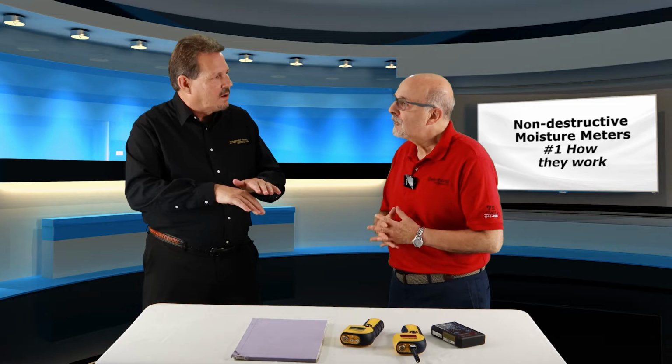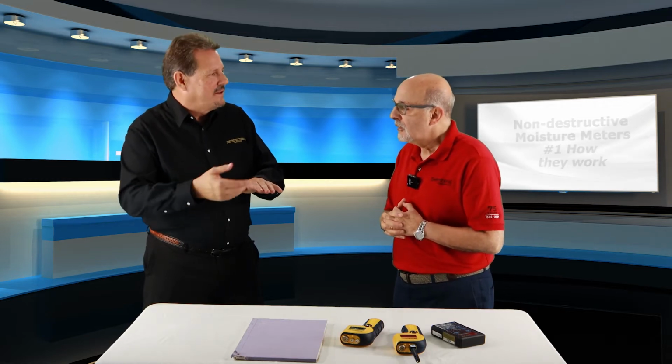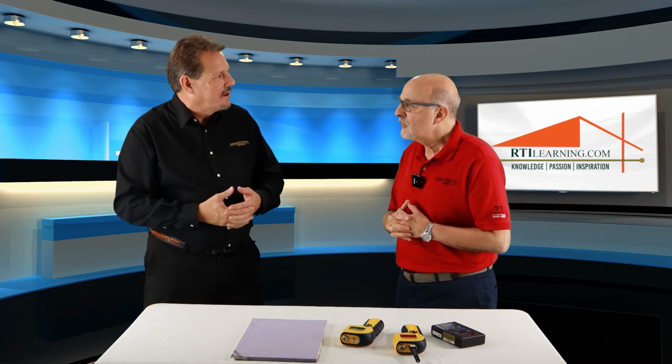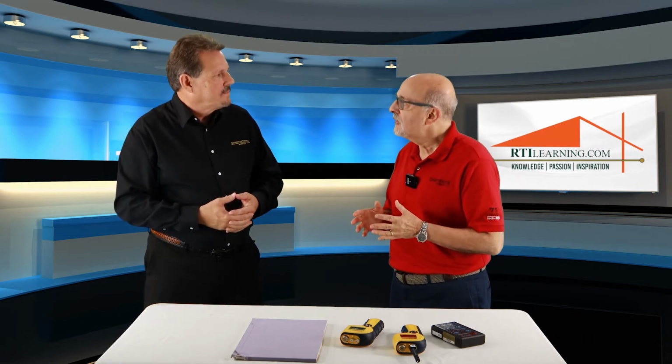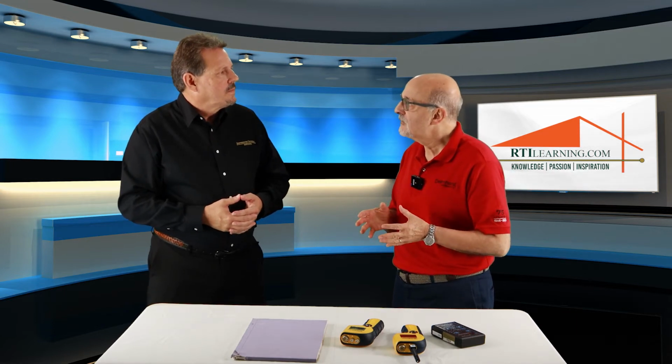Gotcha. So it's actually kind of looking for the density of the material, because as the pores fill with water, air being less dense than water, it changes the density, and that's what the meter is actually looking for. That's right. It operates on the principle of the relationship between the moisture content and the density of that material.